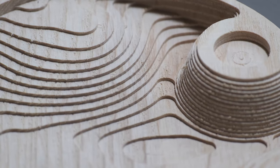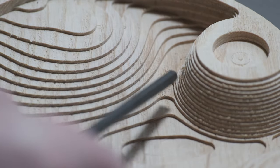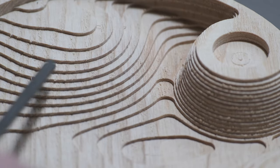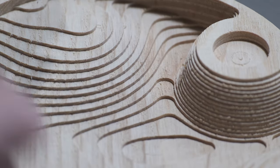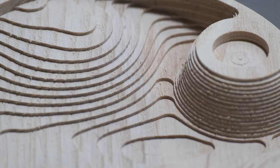This one is straight off the CNC and you can see there are mill marks in there as well as strands hanging off each of the individual levels as it was stepping down. These tiny pieces popping off the levels are extremely hard to sand away — even using an exacto knife is extremely tedious. But once you sand it away with a sandblaster, it leaves a nice clean finish.